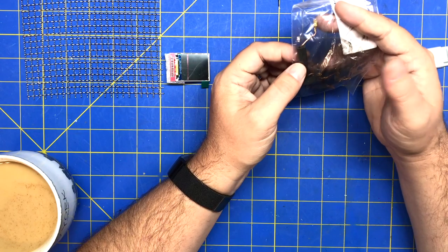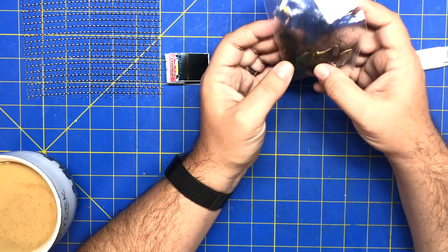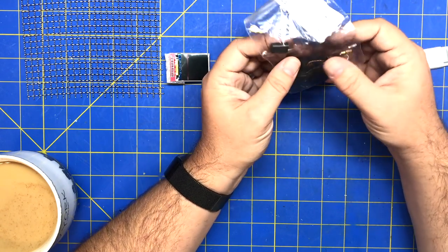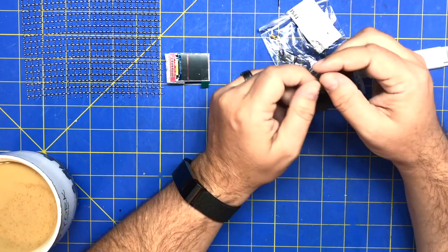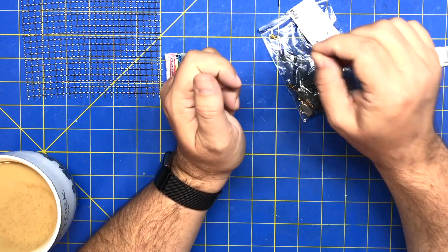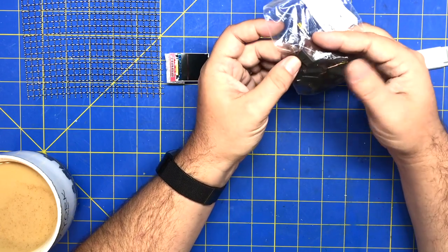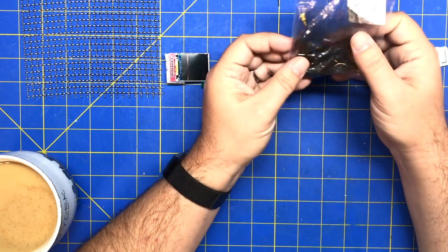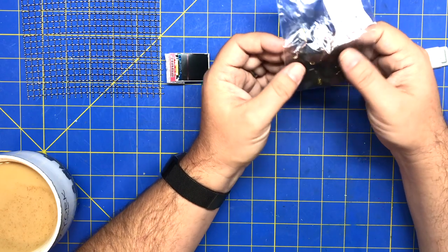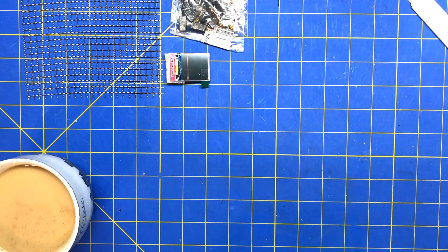I think the carbon prevents the oxidation when you do it, I think. So I thought I'd try that out and use this as the anode or whatever, and then you power the thermocouple wires and you twist them together, and then you just bzzz, and you pump I don't know how many amps through there, and it should weld. These are just carbon brushes for motors. I just bought a whole bag of them. They only come in a whole bag. Plus, who knows? That might be a common size. Maybe I can use it for something. One day I'll need a brush.